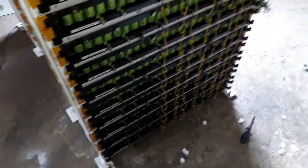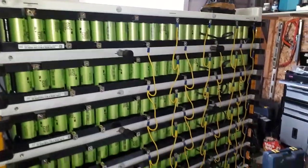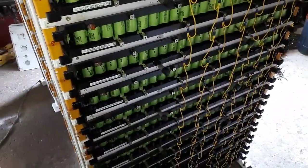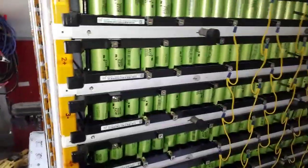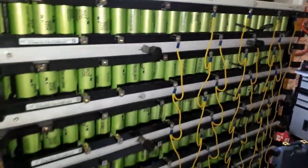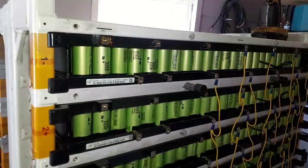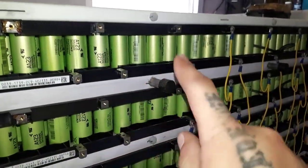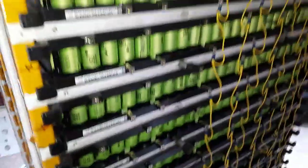So this is where we made it to. I'm out of lugs — I have lots of wire but I'm out of lugs. It's very important when you're hooking these up: I haven't had a spark at all because I've checked all the voltages between all the cells and they're all very even. This top one was 0.1 off per the whole pack compared to the rest, and I still didn't get a spark. There are still five more rows to hook up — one, two, three, four, five — so it goes all the way up and down.